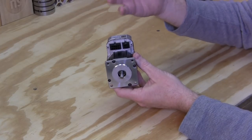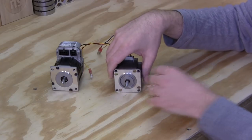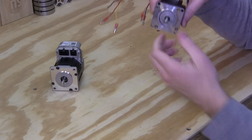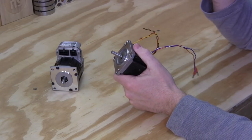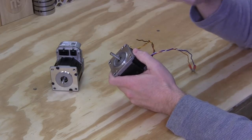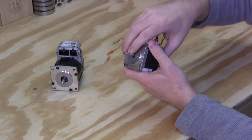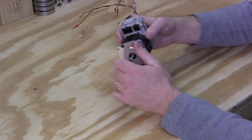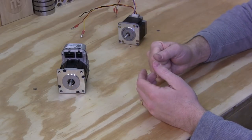So another big difference, I mentioned the steps on a stepper motor, and the chopping that you hear of sometimes. If you've heard my large machine, when I had my old stepper motors on it, it's a very pronounced sound that the stepper motors inject into the machine, because it's almost a vibration, but it's caused by the motors because they're pulsing. And so obviously with this motor, you don't have any of that. It's a true just DC motor, so there is no resonance added to the machine.